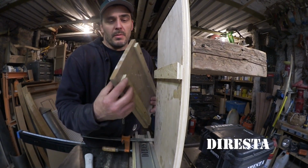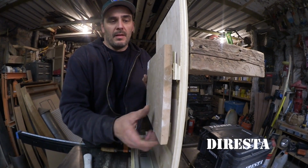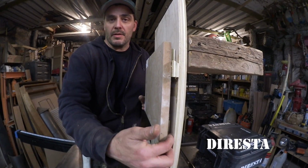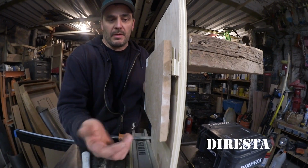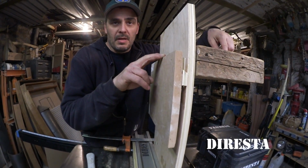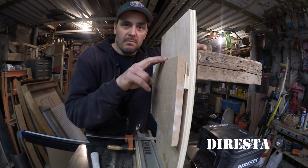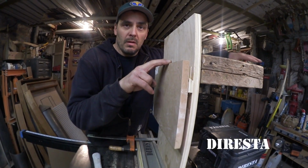It's important though sometimes to put a spacer at the bottom. Sometimes I see French cleats hung and they don't have a spacer at the bottom, or even a second French cleat at the bottom. You know, the more strength, the better. So you can see these applications basically do the same thing, but with the custom metal bracket that I make, you can get some cantilevered action off the wall.